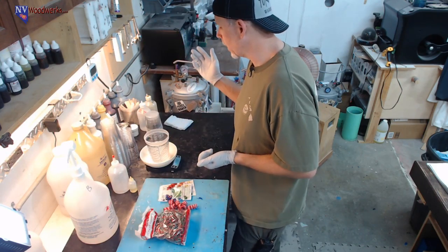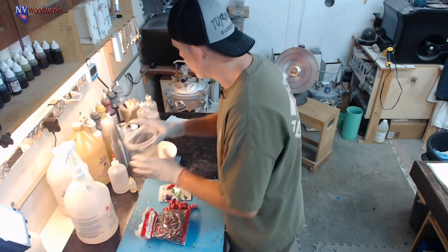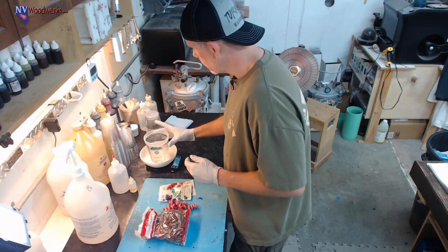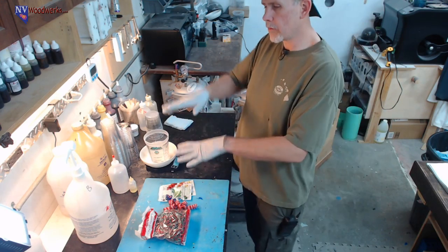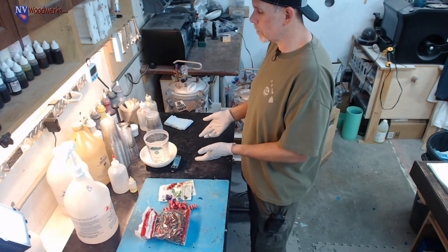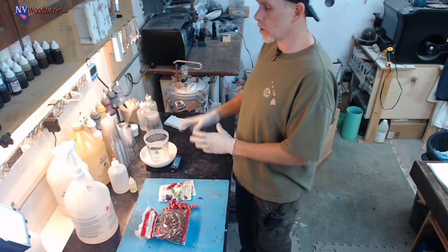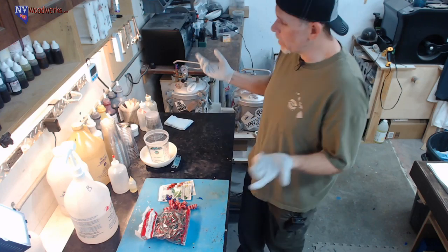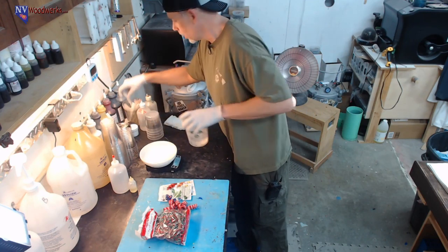Sneaking up on 200 grams. One other thing I want to mention: cooler temperatures can affect your scale. Manufacturers generally recommend using a scale at room temperatures. Sometimes when it's too cold it can be weird and fluctuate. It might be better to turn it on and let it warm up if you're heating your shop from cooler temperatures — it may just be a little bit more accurate or not fluctuate as much. Depends on which scale you're using, but just wanted to mention that.